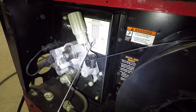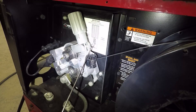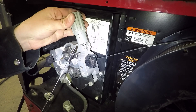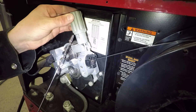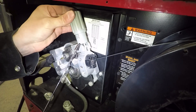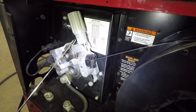One last thing to check: make sure your tension is set right. There's a chart behind this tensioner that gives you ranges. This flux core wire is actually going to fit in the range of the outer shield, metal shield, inner shield. We're going to set this at a three to four range on our tension. Since it was previously on just a steel wire, it might have a little more tension than we need — we don't want to crush the wire when we feed it through. So loosen that up to about a four. Reference this chart behind the tensioner to set your tension.